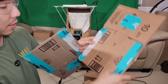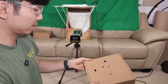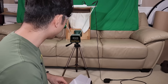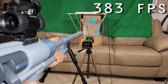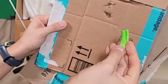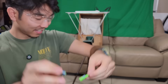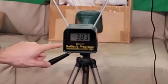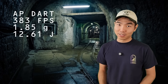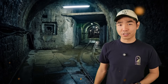It's just the foam that got left behind — the dart head separated. Looks like it punched through this side as well. It punched through seven layers with this — that's pretty cool. Let's test that again. 383 feet per second. Looks like the dart went in sideways. The foam flew inside. Foam left behind again. Seven layers — significantly fast, 383, close to breaking 400. At 1.85 grams, that's 12.61 joules. It's officially more powerful than a paintball gun.